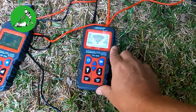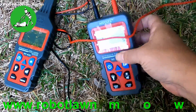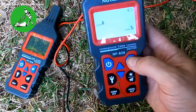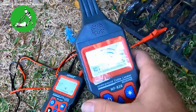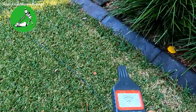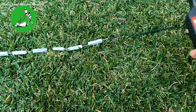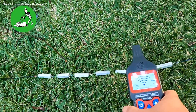In this case, because we know it's pretty much a complete break, we can set the power level to level two, which will be perfectly fine. Press OK, press the play button so it's transmitting a signal — turn our transmitter on. You'll see it's going to read around 300 straight away. Because this is a decent break, we should be able to just walk along until the sound basically stops. Whether you use the NF820 or the NF826 you'll get the same outcome.